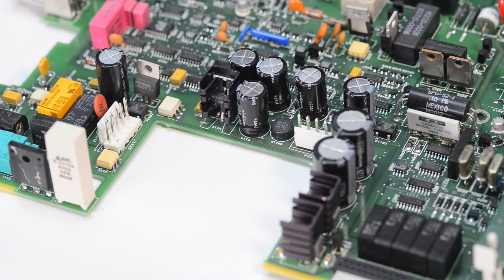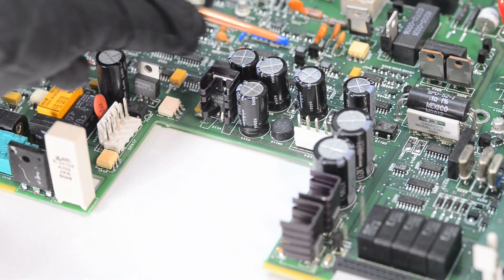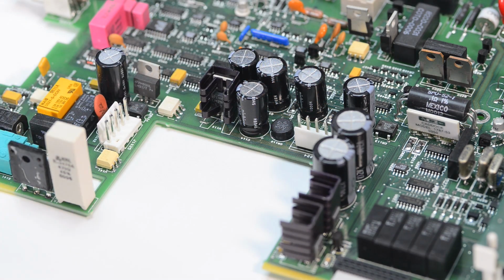Power supply issue is a common problem with these old Keithley 2001 and 2002 multimeters. All of these capacitors are Nichicon VX series, so they are actually decent capacitors, just not designed to run in these hot conditions for many years. As a result, all these capacitors would need to be replaced if the instrument is old and already has stressed parts.